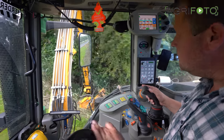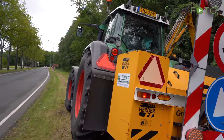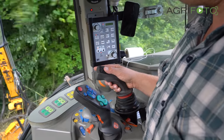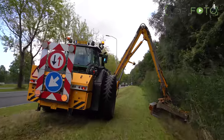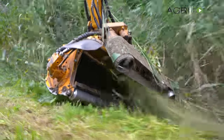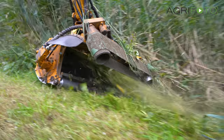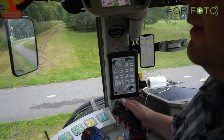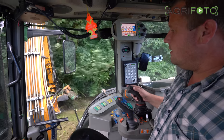Notice the relocated Vario terminal for an unobstructed view on the mowing arm, which is controlled using a single joystick and foot pedal. The flail head doesn't have any trouble with the reeds that are over two metres high, doing a good job of cleaning this ditch. Operator Frake uses an app which shows his location and which parts of the ditch network need mowing.